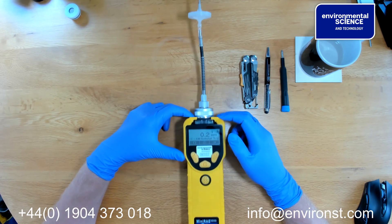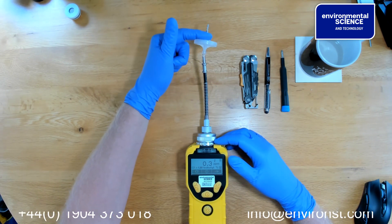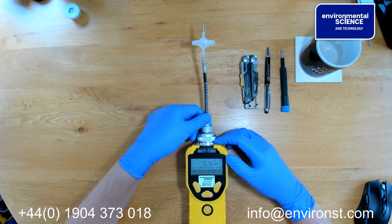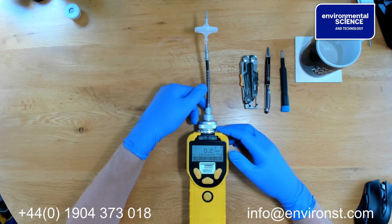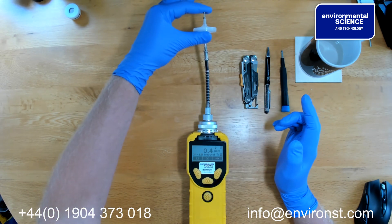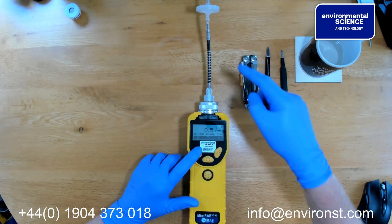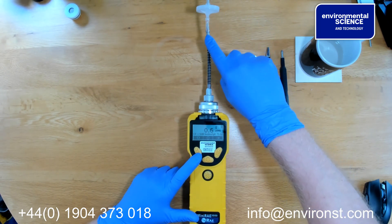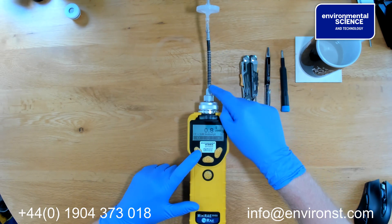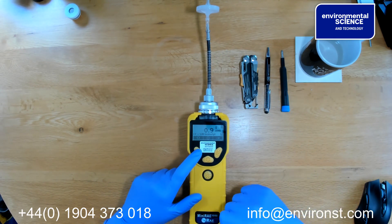The first thing that we need to check is: one, a filter is in place; two, your probe is properly attached; and then three, with both of these in place, that your unit stalls. This is to check the integrity of the sample chain and to ensure that there are no fractures or breaks along the length of the probe and that your pump is functioning correctly.